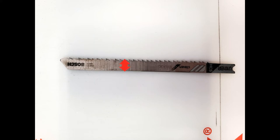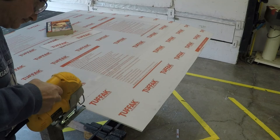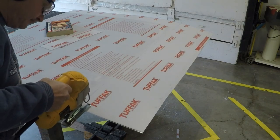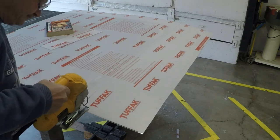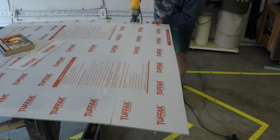And how wide is your blade? The wider the blade, the easier it is to cut a straight line. Any time I cut this stuff, I always start the cut on one end and go part way in, then finish the cut from the other side. This keeps you from chipping out the edge of the plexiglass or Lexan.